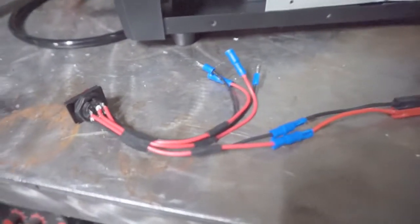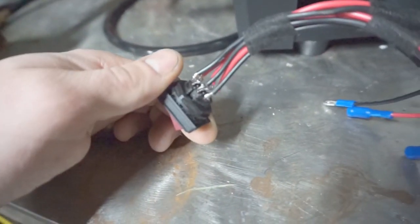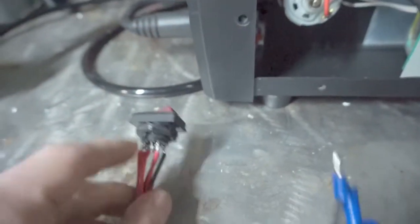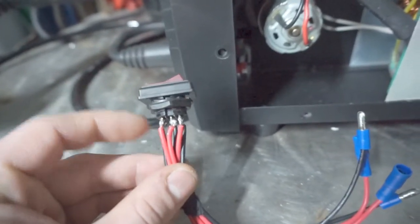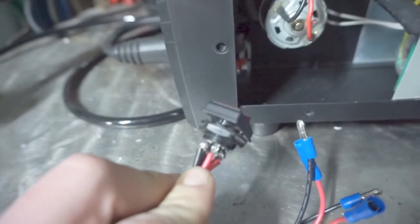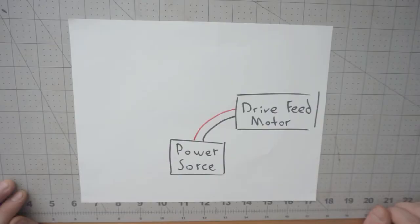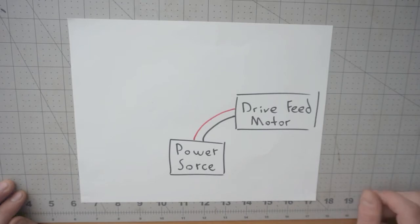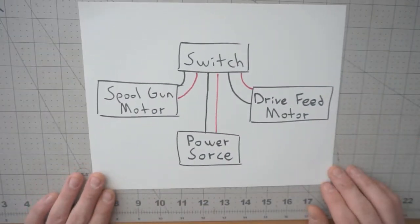Here's what we have going on. We got a switch that has three positive leads and three negative leads. Power comes in through the middle leads, and whatever way the switch is pointed, it puts power to those leads. So right now the top two wires would have power, and if I switch it, the bottom two will have power. A wiring diagram helps illustrate how simple this is — the original layout is just two wires, the red and the black, that go from the power switch to the wire feed motor. All we're doing is adding a switch and a couple of wires, and this lets us choose when the power goes where.